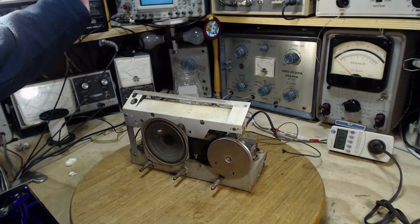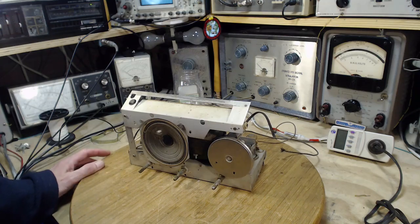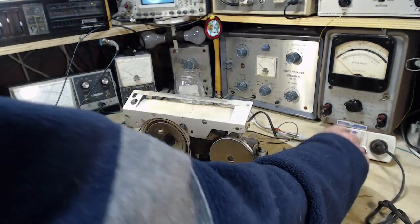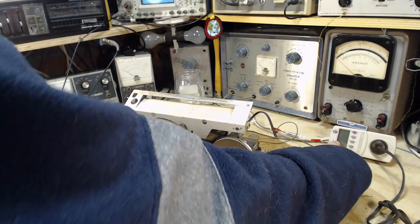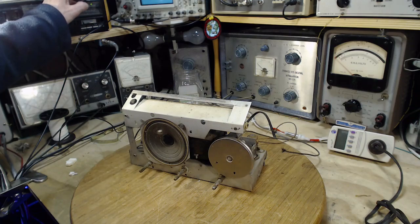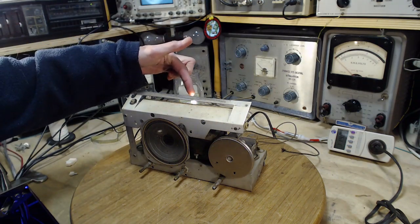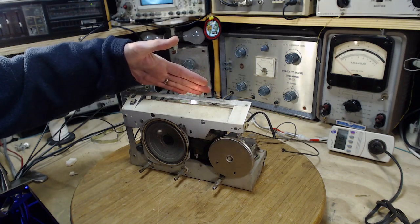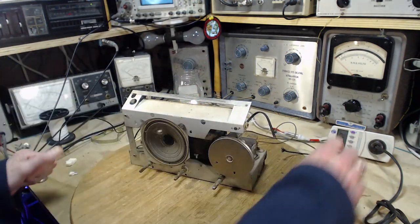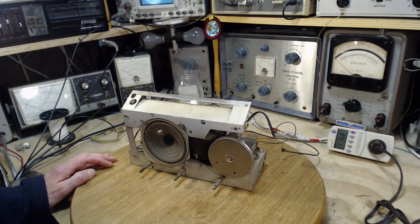Okay, I'm going to turn the power off. Keep an eye on this thing if you like. I'm going to switch it on here, and we're going to apply power and hope two things happen. This doesn't show that same number again, and this light comes on a little bit. A little bit. Okay, we're in business. The light came on up here. 116 is a little low, means it's drawing current, regardless of that resistance reading I took. And here comes the radio.